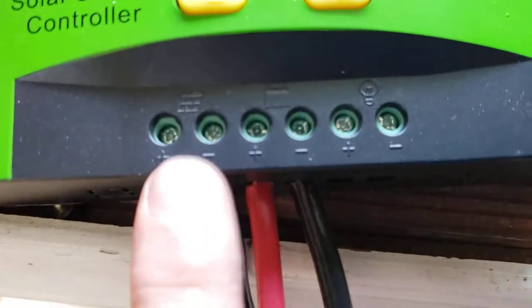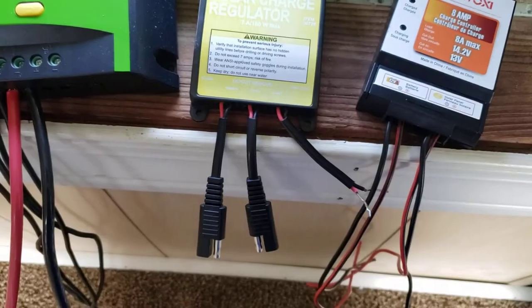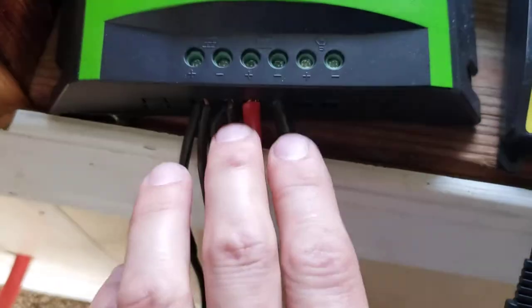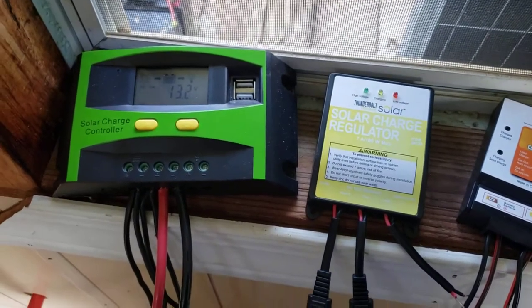So to run through it again — it's very easy. Solar panel positive and minus goes in here. If you're using one of these smaller charge controllers with SAE connectors, just make sure you're following the correct polarity — red to red, black to black. Then you'd have your battery wires coming out of the charge controller going out to the battery, completing your circuit. Same here — run it out to the battery. Then just take a set of wires and bring it right to your inverter. As you can see, the battery outside has two connections: the inverter leads and the charge controller lead. I hope this helps — thanks for watching, please subscribe.